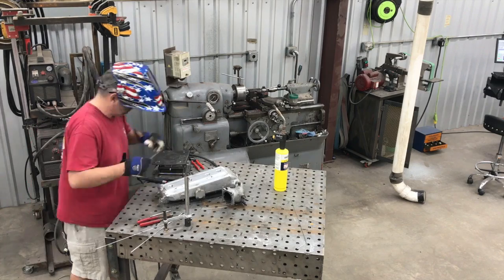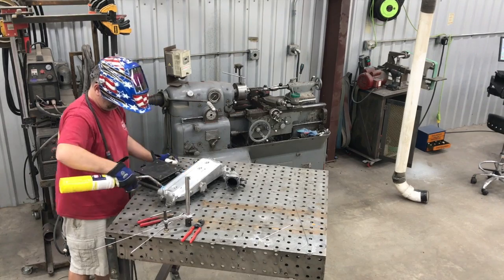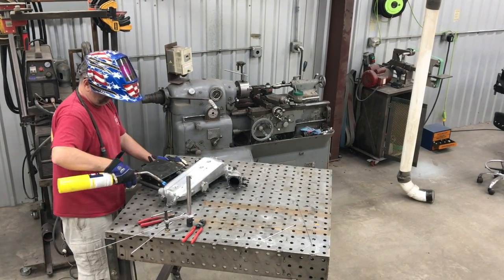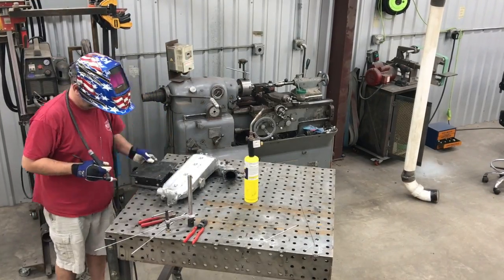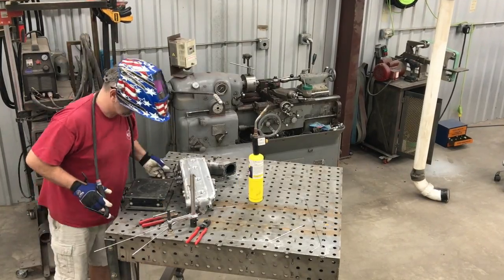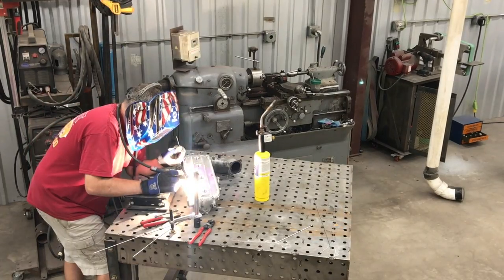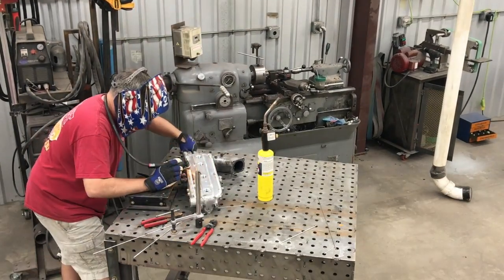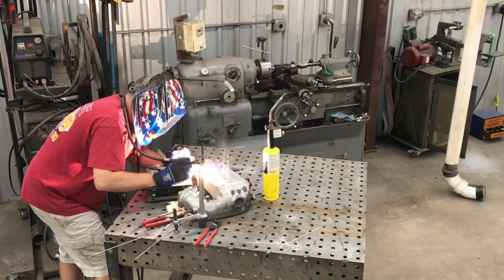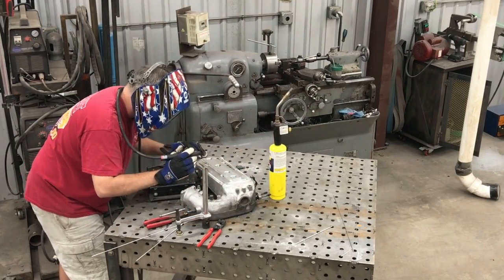We had a really good fit on the gaps all the way around the edge, which was a good thing. I'm running the Eastwood TIG 200 and doing a preheat here with MAP gas to get some heat into the intake before starting. Once I started with the beads I didn't stop — I just kept welding so the heat continued to stay in the intake. There were a couple spots where I'd go get some of the soot off with a wire brush, but in general I just kept the thing flowing.